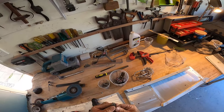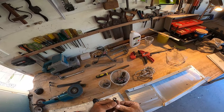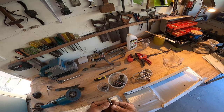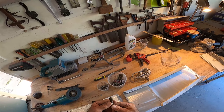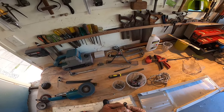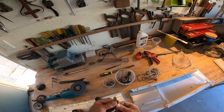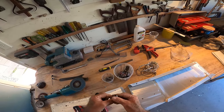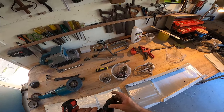This is the best kind of countersink for non-ferrous metal including aluminium. It'll cut a nice even countersink quite freely, whereas the conventional type of countersink meant for steel or wood will tend to get loaded up with the aluminium. I'll show you how it works.